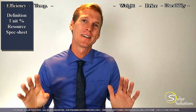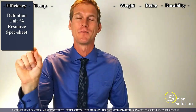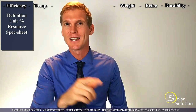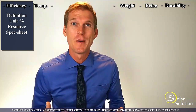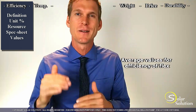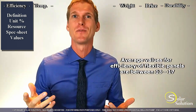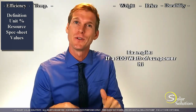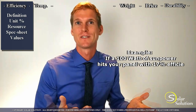So highlight it and remember it. When I say specification sheet, please don't get scared away — it's not rocket science. When you're looking online for panels, somewhere on the bottom of the page where it says the price or order, it will give you a button that says download specification sheet. Click on it and you get this PDF document of two to three pages. You probably want to know what kind of efficiencies you can expect. Well, they're roughly in the range of 13 to 17%. For example, if sunlight with an equivalent of 100 watts would hit your solar panel, it would then produce 17 watts of electricity. Makes sense, right?